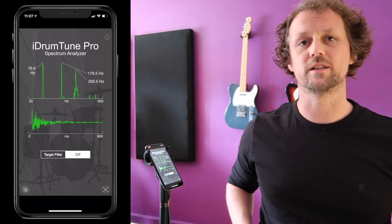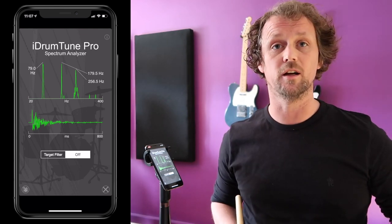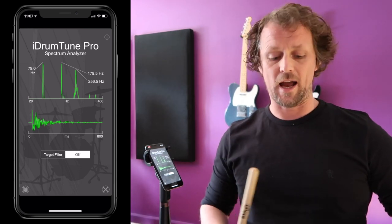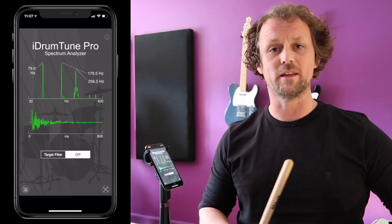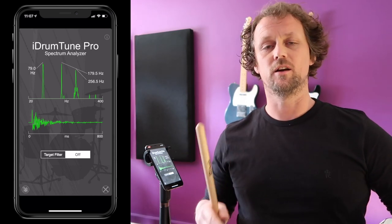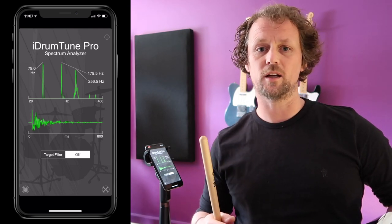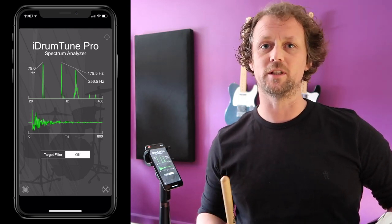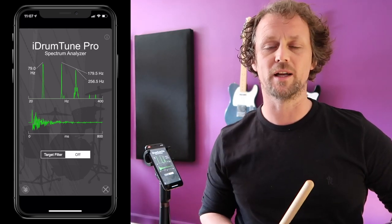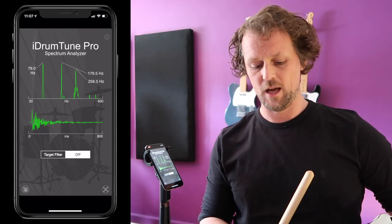Okay, so the frequency has now gone back up a bit. It's now gone up, the lowest frequency, to 79 hertz, and we can see some more frequencies have occurred now, because actually now we're starting to add a lot of weight. There's now lots of things bringing different frequencies. Now again, like I said, those frequencies are dependent on the way the system is constructed and how they interact with each other, rather than just saying, well, this bit vibrates like that and this bit vibrates at another frequency. Once we add them together, they all find new frequencies.